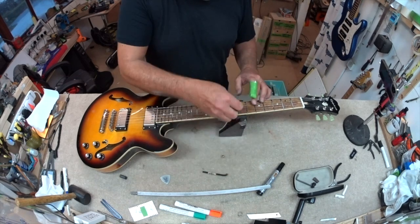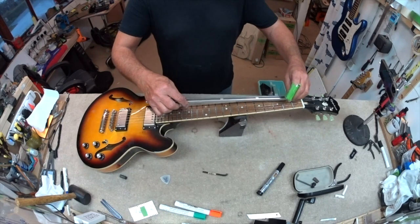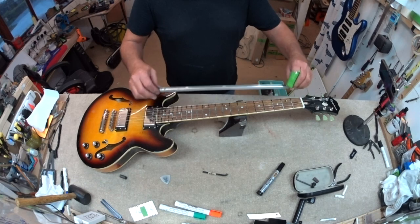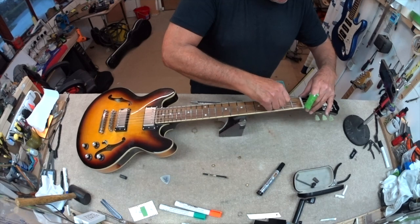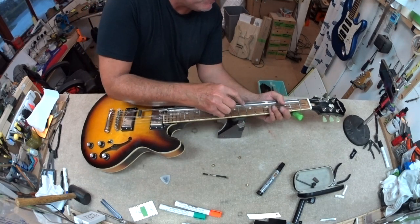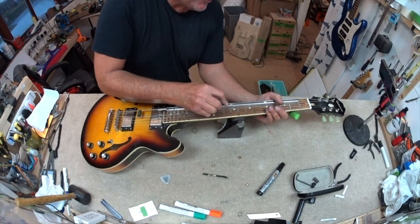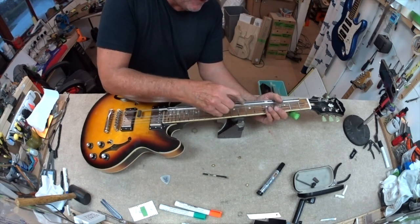So now I'm going to recalibrate again for the A track, and I'll do the same again in a minute for the E track. And again, from here onwards now, I'm really thinking fret slap as our main enemy for such a low action and a flat neck as this. So there's nothing surprising about the fact that there'll be fret slap. The strings don't have that much room to move because we've made a flat neck and a low action, but that's deliberate. And so what we're doing is challenging the frets to work with that, and that's why I use this technique the way I do.